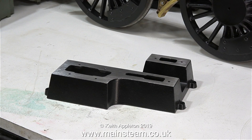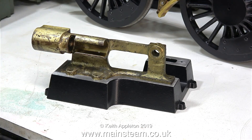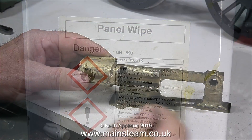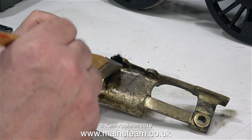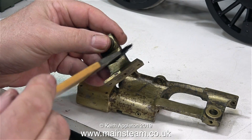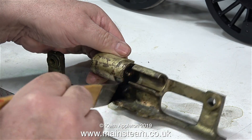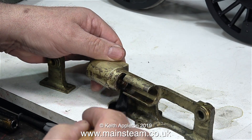This is the cast iron base, and I've removed the paint from the top surface, because I think it will look better and provide a more accurate platform for the engine. And before giving it a coat of etch primer, the first thing to do is to clean it off with some panel wipe. I'm using this on a paint brush, and you can see clearly all the oil running onto the bench. Not forgetting the outer crankshaft support pedestal, which is also quite oily. In between these clips I cleaned the brush, applied some more panel wipe, until I got rid of every trace of the oil.